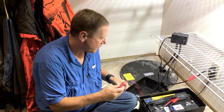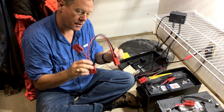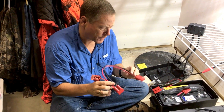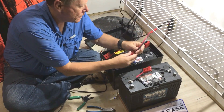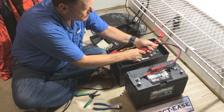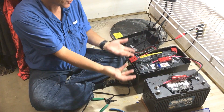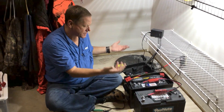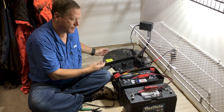We've got the connections all done — we'll let them cool off a little bit. Now we're going to use our parallel kit, which you can find on connect-ease.com. What it does is it hooks up to your particular battery like so, put this one in, and now those batteries are actually in parallel. That parallel connection will use both batteries to power the backup sump pump, so it will last probably somewhere between two days or possibly even three or four days depending on how often the sump pump runs.